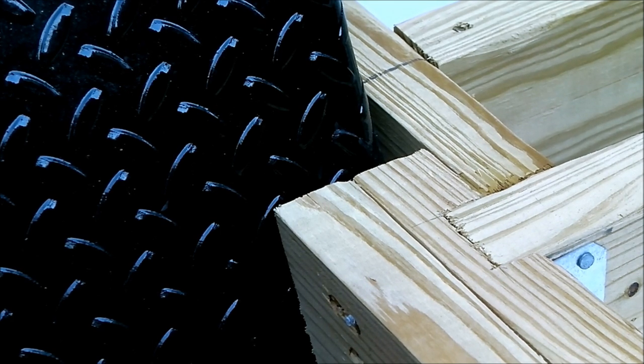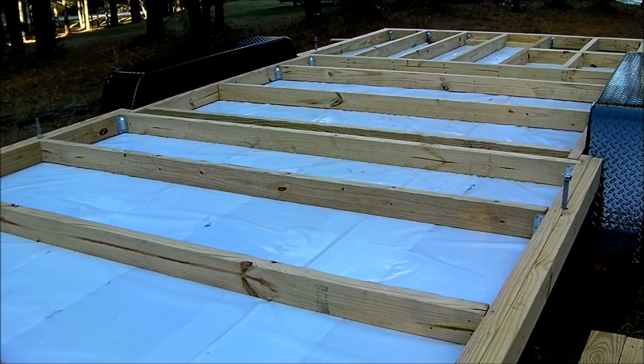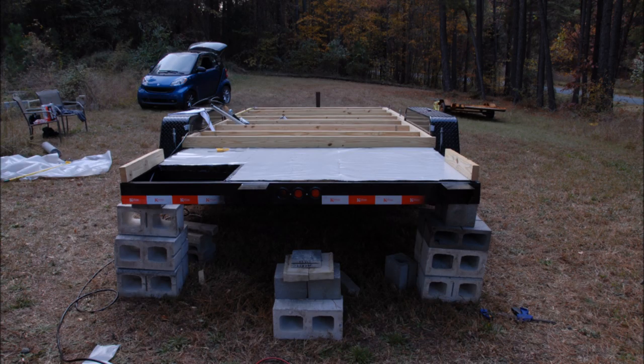One thing I want to note is that these floor joists running left to right aren't placed randomly — they're spaced so that as I'm laying my sub-flooring plywood on top, they'll land at two-foot increments. That way I know exactly where to screw the sub-flooring down without having to guess or miss the studs. All of these are at two-foot increments on center.